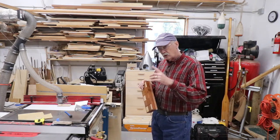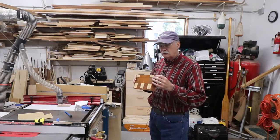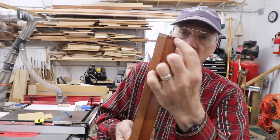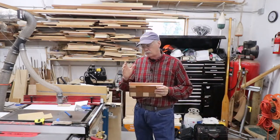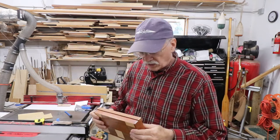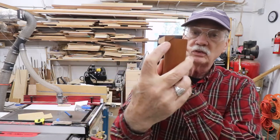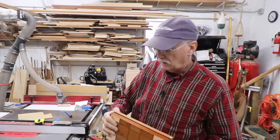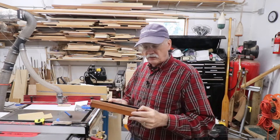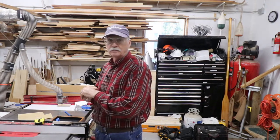Slight change in plan. The triangle glued on very nicely, but look at something here — this is not a rabbet joint, this is a weird miter joint with an exposed end. You'll note there is exposed end grain there. So if I ran this almost to the edge and then put a veneer on either end, it wouldn't look right. What I do instead is cut it to fit within these two spaces here and here, and then cut some triangles to go on the ends so it'll match the thickness of this right here, and also expose side grain instead of end grain — so it won't look like just a thin piece of veneer.